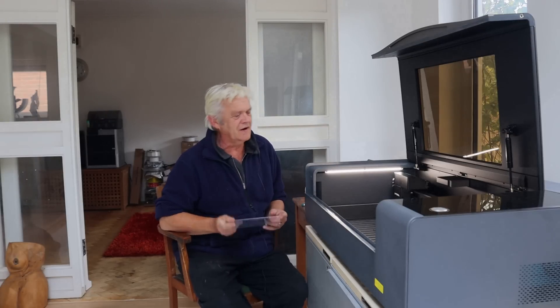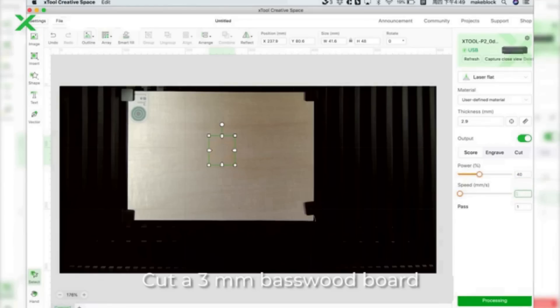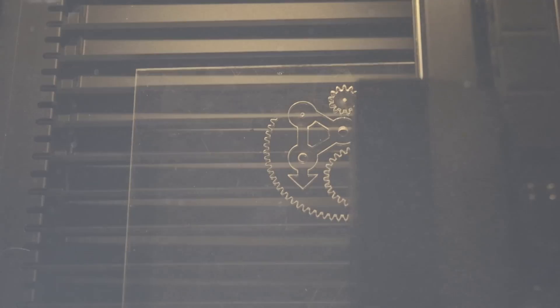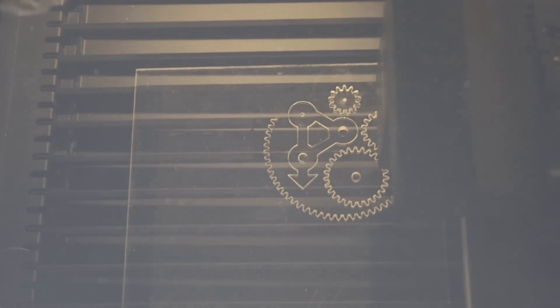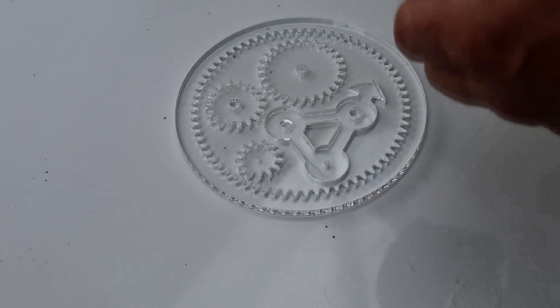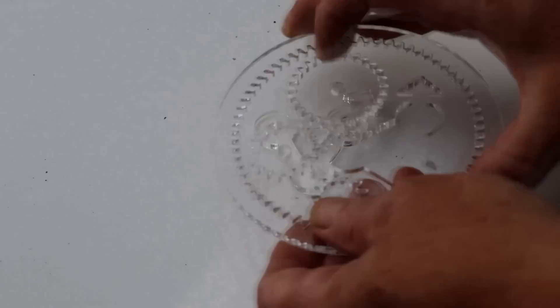Now for the exciting bit. I've got a bit of five millimetre acrylic that I'm just going to bung in the machine and cut it. Cutting it is really easy because there are two cameras in this machine, and those two cameras mean you can position things very accurately. You literally bung your material in, close your lid, upload your SVG to XCS — which is the workspace — move it to where you want to cut it, select the right material, and hit enter. That took three minutes and 48 seconds to go through five millimetre acrylic — have a look at the edges, they're almost polished. That's so beautiful, and they just pop straight out.